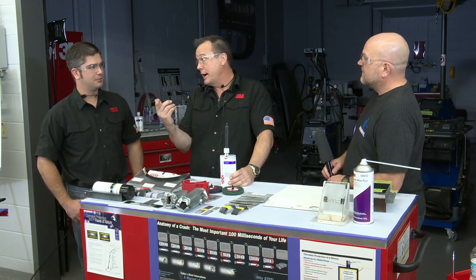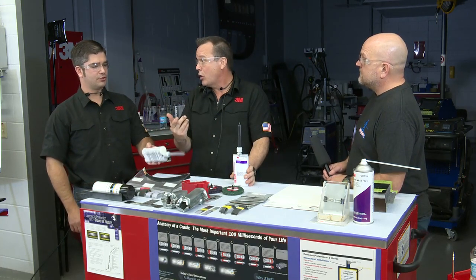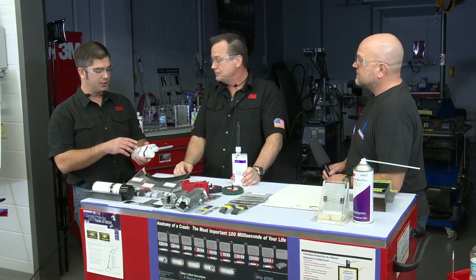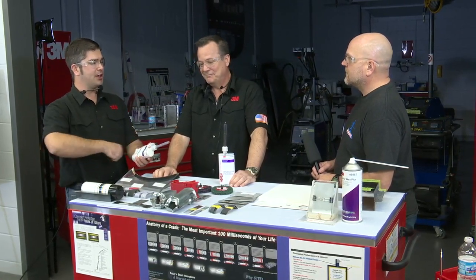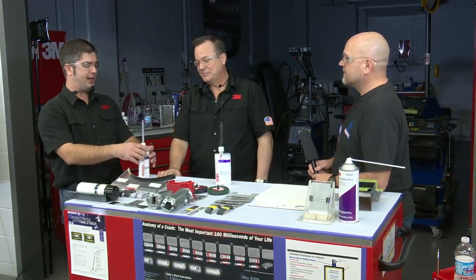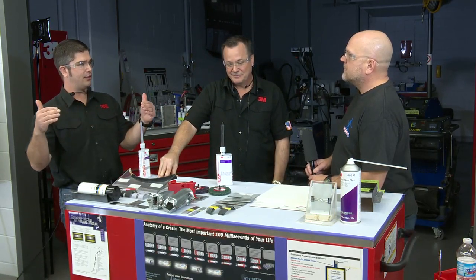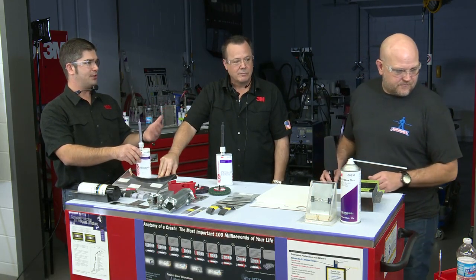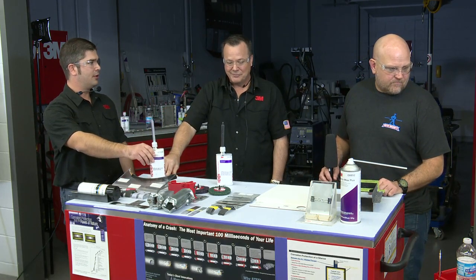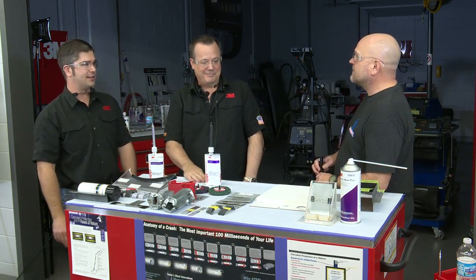It's a good idea to have an infrared thermometer to check that temperature and see if it's getting warm. One of the things that you mentioned, which is good, is you want to cool it or warm it over a period of time. You don't want to take your heat gun and warm up the cartridge, because the outside is going to be warm, but the inside will still be cool, and you'll get inconsistent cure throughout the repair. So it would be a great opportunity, the night before you go home, to put a few cartridges on the desk in the office, and then come in the morning, and if the office stays at 70, great.